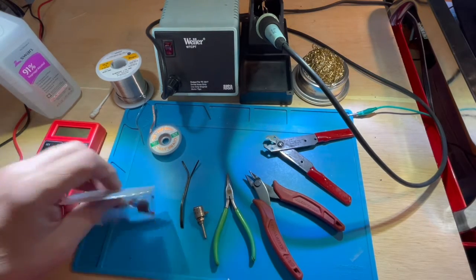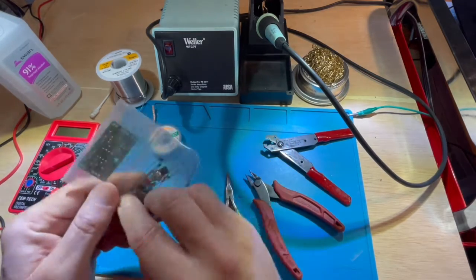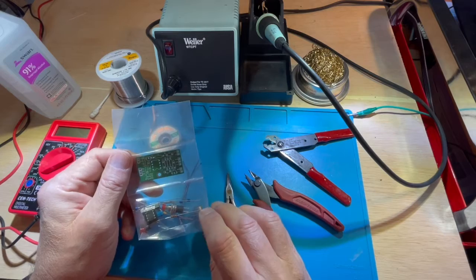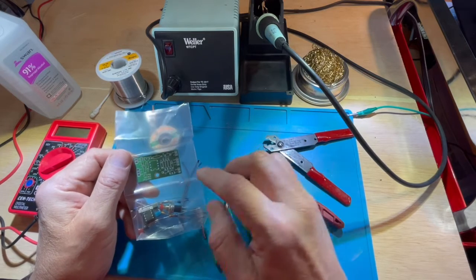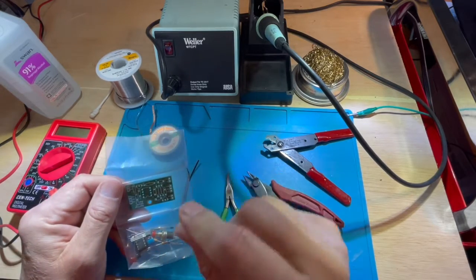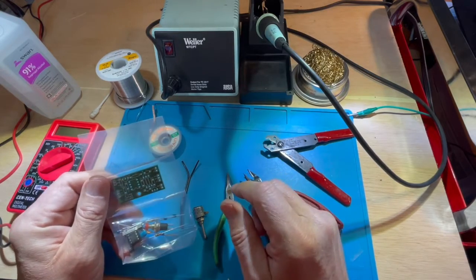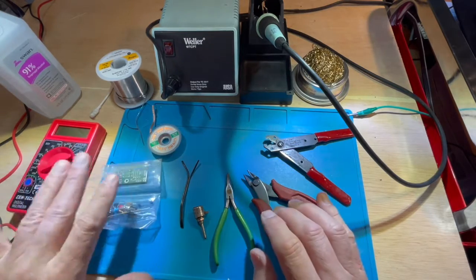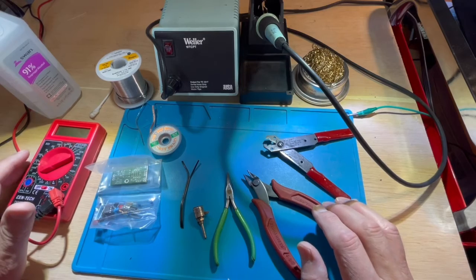Lastly, what we're going to show here today at the very end is soldering or attaching components to a circuit board that happens to be an electronic keyer. It's called the NorCal keyer. You attach a paddle or an on-off key to the board, and out of the output comes a modulated Morse code representation of what you entered on the iambic paddle, for example. And it has memories. It's a really cool little project. We'll show parts of that, and if we're lucky, I'll be able to show the completed project at the end in operation.